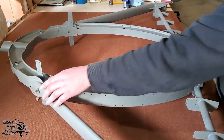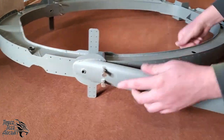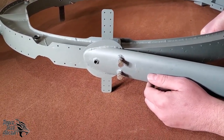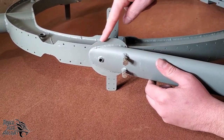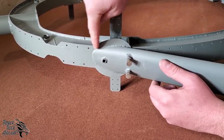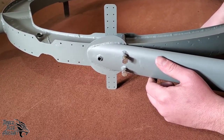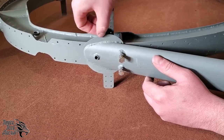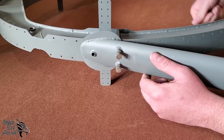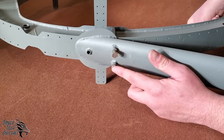One thing you can do up here, keep in mind these aren't the bolts that we'll be using in the kits. These are some scrap bolts we had on hand. When you get your kit, you might notice that this is lopsided or oversized. It is okay to grind this back, this pad here on the strut, until it looks pleasing to your eye. We usually use about an eighth inch away from the edge of the weld bead as our guideline for getting that right. Now, do not ever grind into one of our welds, okay?